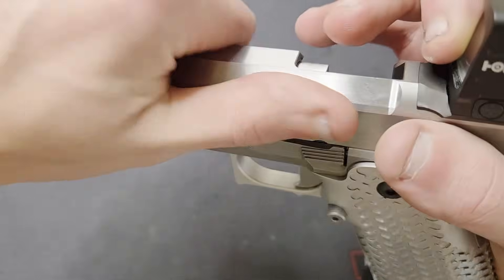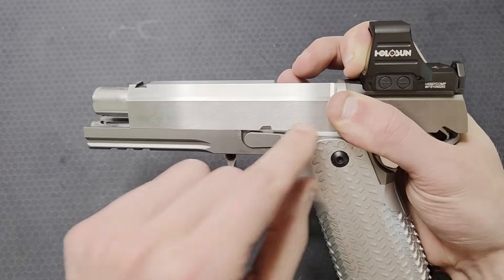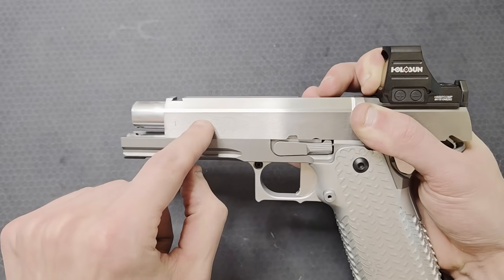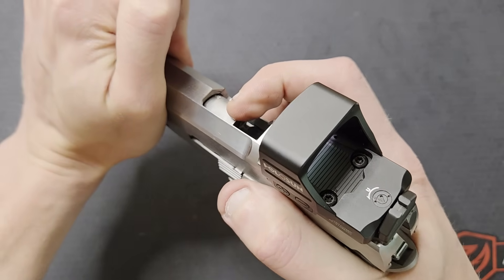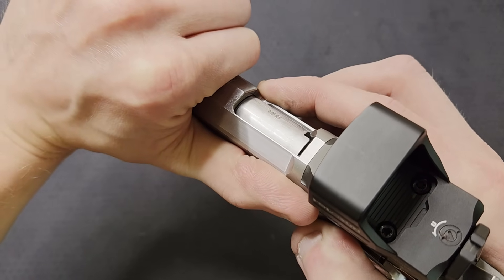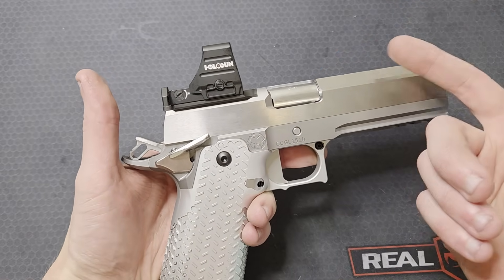Let's see what's happening now. When the barrel is linked down, it no longer rocks on a point somewhere between the slide barrel passage and the frame impact surface. I can tell it's only contacting back here and up here. As the slide is pulled back, the chamber consistently drops all the way down. As the slide comes back forward, it's no longer being lifted up by the slide barrel passage. I think this should take care of the majority of the contact between the top of the chamber and the slide.